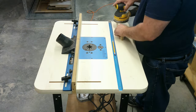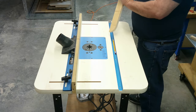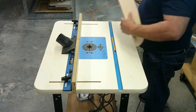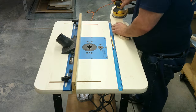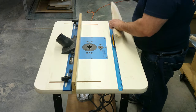The fourth step was to lay out and cut the radius in the top side rails, base posts, and base legs. I used my band saw to cut the radius after laying the radius out on the parts. The radius cuts went pretty fast, although I was not rushing the process, but focused on the job and where my hands and fingers were in order to avoid injury.